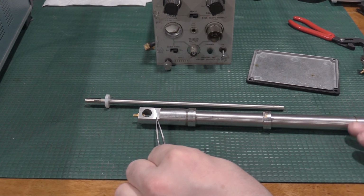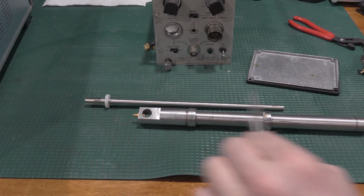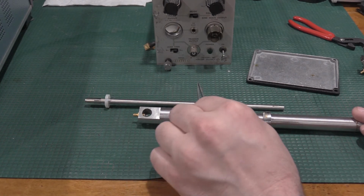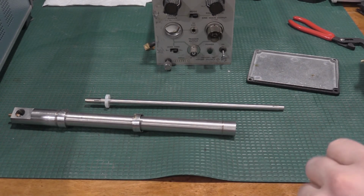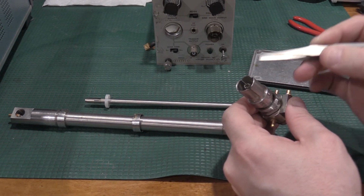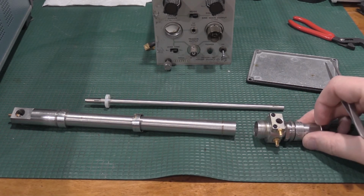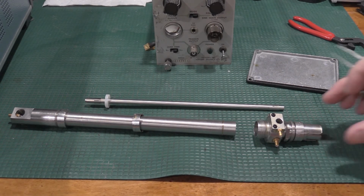That's back here in that enclosure that I had to rebuild. It has those two biasing resistors inside it, and then it has the back terminator, the 50 ohm reverse termination for the transmission line in this housing. The 50 ohm termination on the front side is the 50 ohm terminator that you have the cable hooked up to. So it turns everything into a 50 ohm transmission line. And that's how one of those tunnel diode pulsar enclosures work.